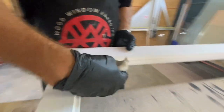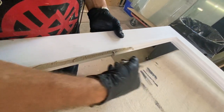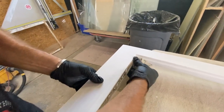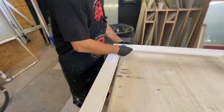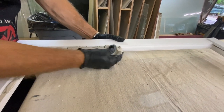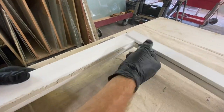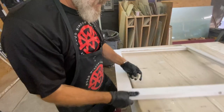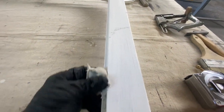This piece of glass I just cut in, what's called a bed, right? So I'm gonna bed that glass on this little shelf here in this glazing compound, okay? See how I do that? Yeah. I challenge anybody to be able to use my thumb technique to get that bed in there just like that. Most people really struggle with this move. Love it. Now, once you think you got that down, then switch over and do left-handed. So you always want to be able to glaze right and left-handed.